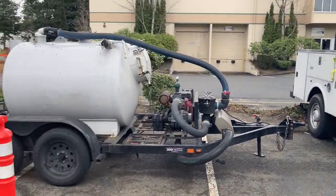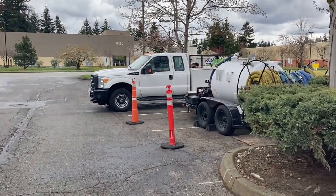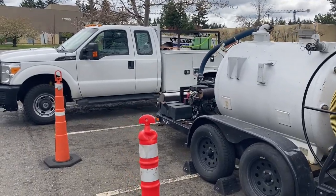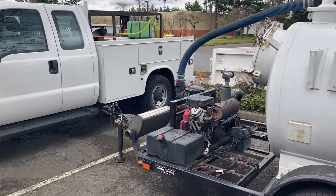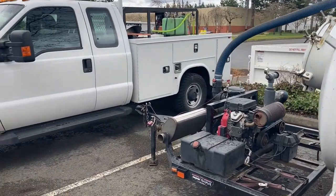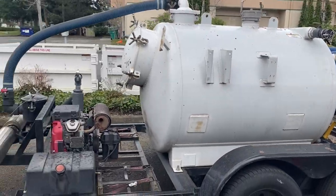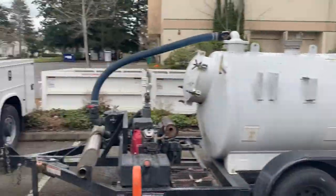You think, well, you should be able to work more and do bigger areas faster. But truth is, when you're doing garages, a lot of them are residential HOA garages for condo buildings, and they basically can't keep up with you. They need to evacuate their garage while you're working. So a lot of times you'll only be able to do a quarter or a third or a half of a structure in a day, just because the closure options are limited. They don't want to clear all the cars out in the city of Seattle because nobody will have anywhere to park, and they complain. So about 30,000 square feet a day is pretty good per system, up to 60,000 square feet per day per system.